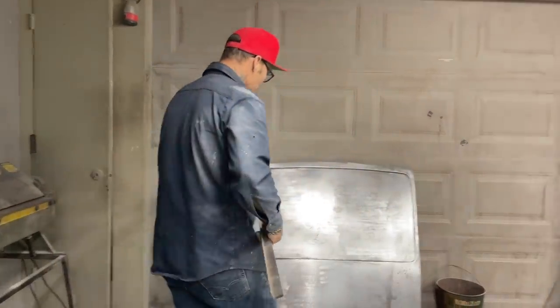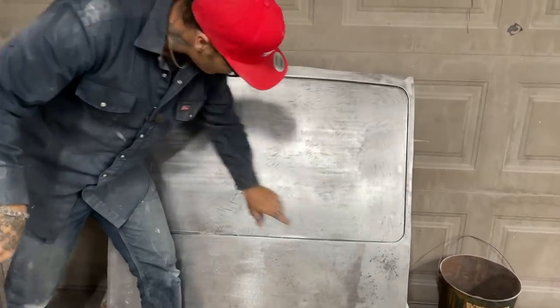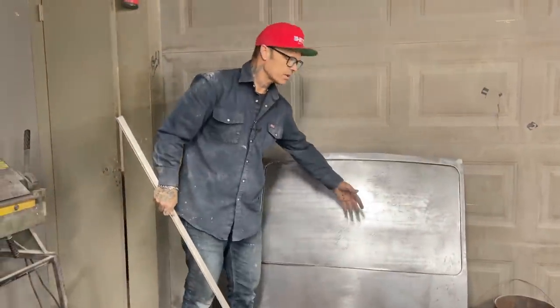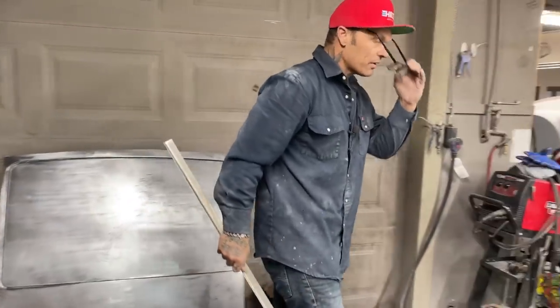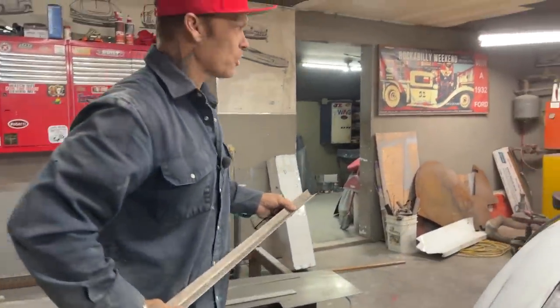Speaking of that, you can see where I stripped the roof panel that I cut out of the car originally. We're going to use it for a rumble seat. You can see how they stripped it with the grinder right here. You can see how it's all gouged. I think they must have found out what they were doing and then stopped, basically. So this stuff here, it's gouged. You'd have to repair that either by piling the primer on it, blocking it off, or putting a skim of filler or two-part putty on that to fix it. But basically, using a grinder or a flapper wheel is not the suggested thing to do to strip your car. That's why I like to use 40 grit sandpaper. It will sand off with an 80 grit, and it'll polish up again nice.